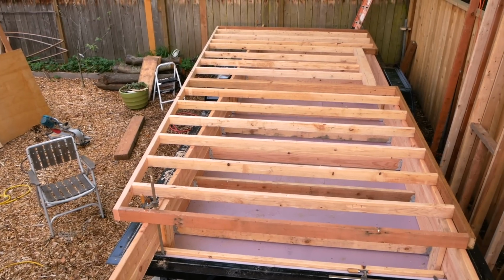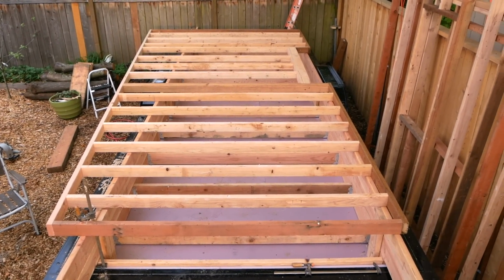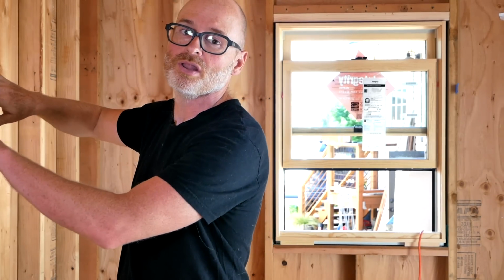And we made kind of a dramatic decision on the north wall here, which was not to add any windows at all, because your north wall is going to be your coldest surface. It's going to be where your least amount of light is coming from, at least in the northern hemisphere. And so every window over here is giving you less light for a lot more thermal loss.